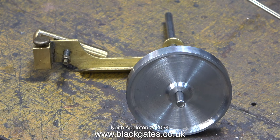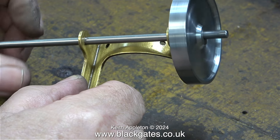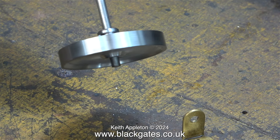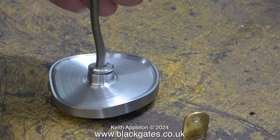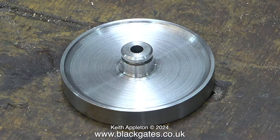I push the piece of steel that's going to be the crankshaft through the centre of the flywheel, then spun it in the engine frame. To demonstrate how well the crankshaft fits into the flywheel, I'm holding it in this position and the flywheel doesn't fall off. It's not an interference fit, it's just a very good fit. And it's quite incredible to think that it came from this rough lump of steel.